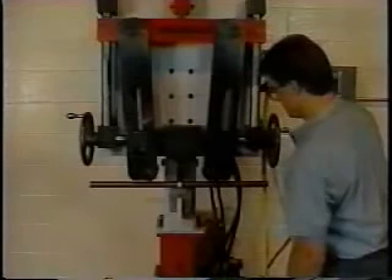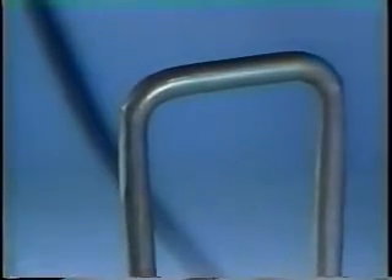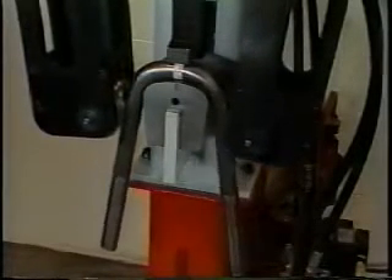Now you're ready to bend. Move the bending arms down until the U-bolt is slightly overbent. The L&H Center Mark Bender utilizes an overbend feature — a method of cold-forming U-bolts in which the legs spring back to proper configuration. The U-bolt is bent in a single downward pass, creating equal parallel legs. Unlike other methods of overbending, which squeeze the rod and reduce the diameter of the U-bolt, damaging the shoulder area, the Center Mark Bender overbends low on the U-bolt leg, eliminating contact with the critical shoulder area, assuring the integrity and diameter of the entire U-bolt.